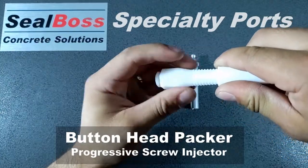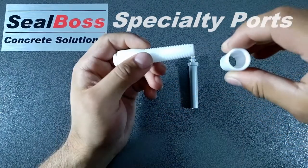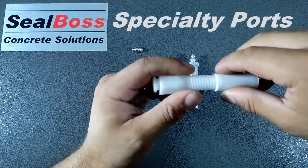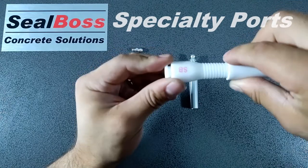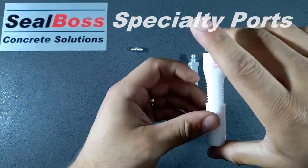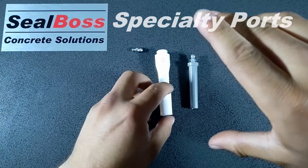As well, these packers all come standardly equipped with the sleeve. These packers are placed into your 5/8ths drill port, and then you can go ahead and replace the packer top if you have any second injections that need to be completed after the initial first injection.